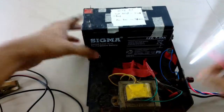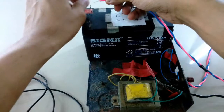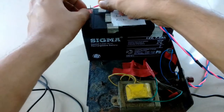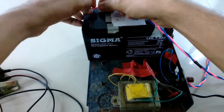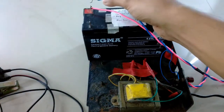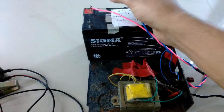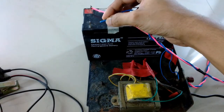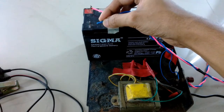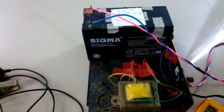When the battery is down I need to recharge it. This is the Jugaad battery charger that I made — you can also see a video related to it in my playlist called 'Jugaad Battery Charger.' Now I'm connecting this charger with the battery. This charger does not have an auto-cutoff feature, so you need to monitor the battery voltage — if it gets above 14.5 volts, the battery is going to get damaged.